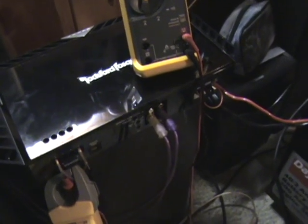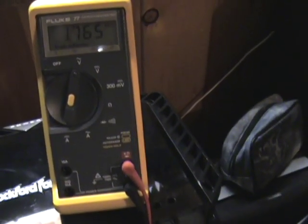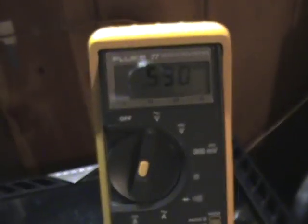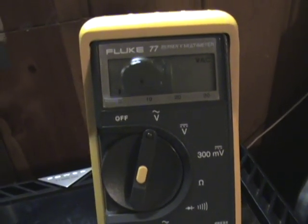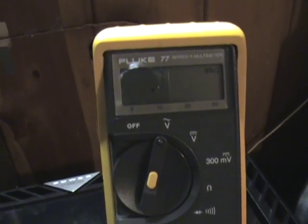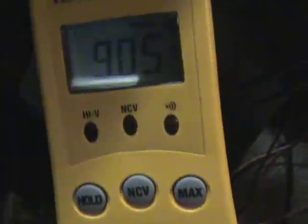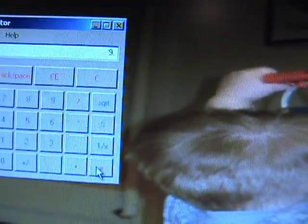Alright, to do this, just play — I got a 40 hertz test tone so I'm going to play that here. And you just turn up the amp when you got a signal going through it. I'll show you here. So there's 41 on that and we got 9 on this one. So all you do is take 41 times 9 equals 369. So it's putting out 369 watts and that's barely even turning the amp up at 4 ohm.